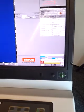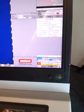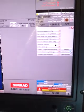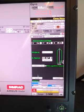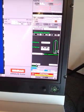Come up to menu and click menu. Down the bottom is radar configuration — click radar configuration. The first thing we're going to do is go into antenna settings and confirm that the height is at 35 meters. It should be preset to that, but in case there have been changes, it has to go back to 35 meters. Click accept.